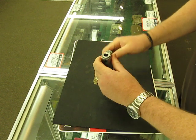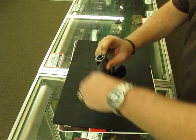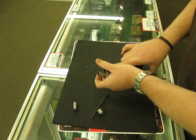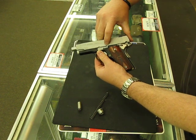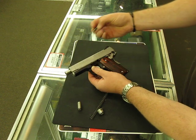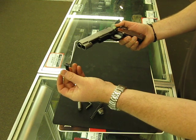What I like to do is start out right here — take out the buffer spring, the tube, bushing — standard 1911 stuff. Pull it back so that that crescent shape is equal with the part of that pin, pull that out, just like that, and that's going to slide off.